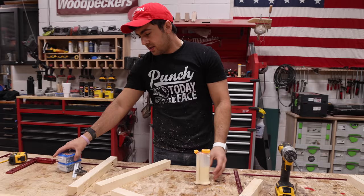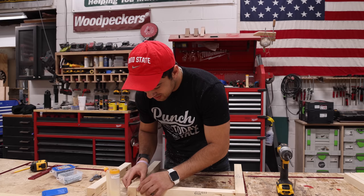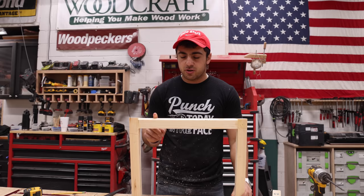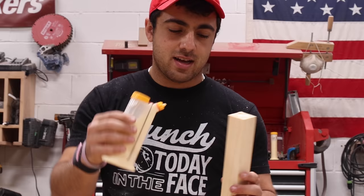Sam was courteous enough to go get me the correct screws — make sure you have the right size screw for your material thickness, this should go a little smoother. For the top pieces, make sure the pocket holes face up because they'll be covered by the top. For the bottom pieces, make sure they face down because no one's going under there — it's three inches off the ground. Try and hide your pocket holes — that's a real hot tip.